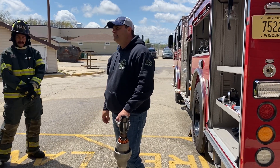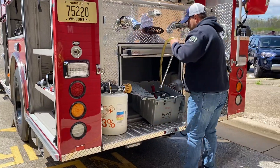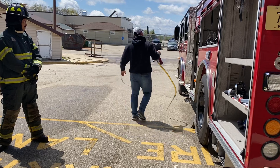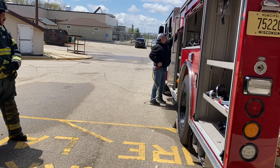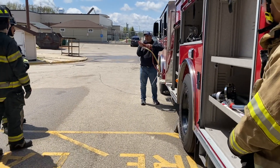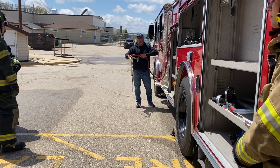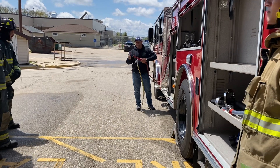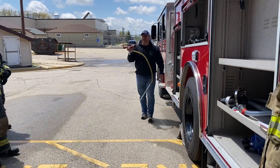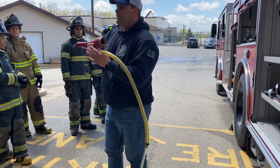So the eductor — you put that into the hose? The eductor? Yes. So the eductor: you have one section of hose that goes here, and then the other section goes there, and the siphon goes right in the bunghole so that the end section goes into the fog nozzle. So from here — there's the arrow right on it showing you the flow of water. And because it's a hose, there's only one way to connect it, so it's pretty self-explanatory.